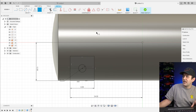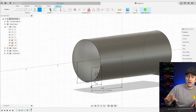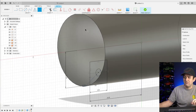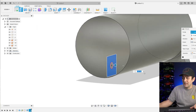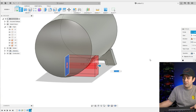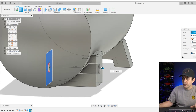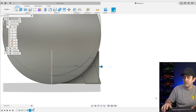How long did it take to learn Fusion 360? Fusion 360 isn't my preference — I'm not all that familiar with this program, but I've been drawing in other CAD programs for so long that most things are similar. There's a lot of things with Fusion that I kind of stumble through, but since it's free it's the best option for these videos. We're taking that profile and extruding it. It goes to Cut first, but we're going to go Join so that it creates material instead of taking it away. 12 millimeters looks good.